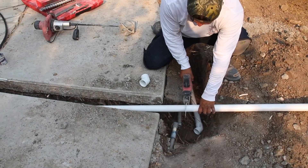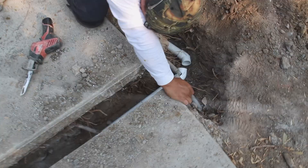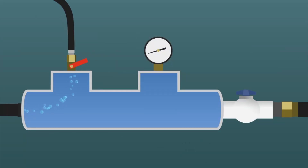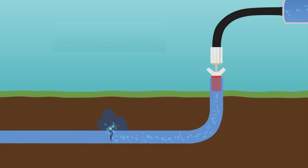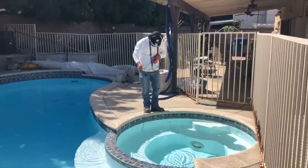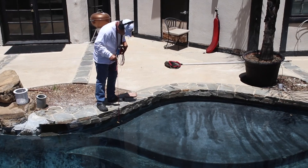Where typical pool plumbing is constructed with plastic pipes, identifying the precise area of the leak can be done using equipment and methods that create the sounds of a leak with user control. This is performed by using the pressure rig included in the kit. Creating pressure in the fluid of an isolated pipe and adding bursts of air will create an easily audible boiling or bubbling sound at the leak. It sounds like this. These sounds are how leak detection professionals accurately identify leaks throughout the swimming pool environment and how repair technicians find leaks and turn them into paid repair work.